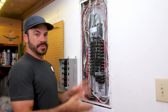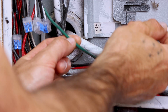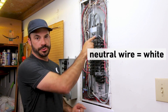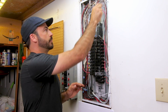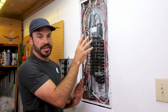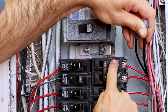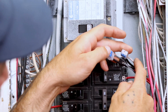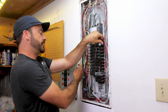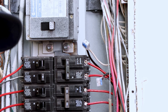With all electrical connections complete, let's review what was done. The ground wire connects to the ground bar and the neutral to the neutral bar in the breaker panel. Then we went circuit by circuit, swapping the wires feeding each circuit for the red wires connecting to the transfer switch, and connecting the outgoing circuit wires to the black wires from the transfer switch. On the well pump circuit, you can see the red wires now fed by the breaker, and the original black and white wires connected via Wago connectors to the black lines returning from the transfer switch.